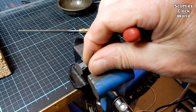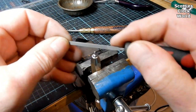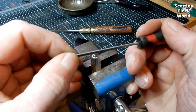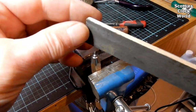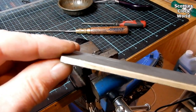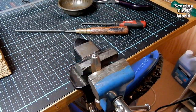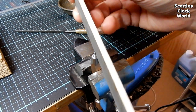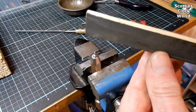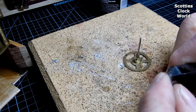Remove the pin vise, stand it vertically in the bench vise, and using the fine file, run round each side of the pin just to confirm that we've removed all the burrs. Finish off with some 600 grit paper on a sanding stick. Final check with your fingers to make sure all the burrs are gone.